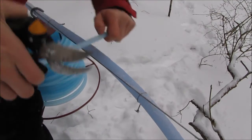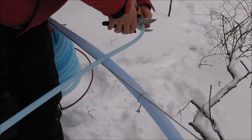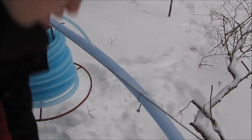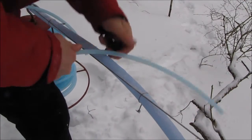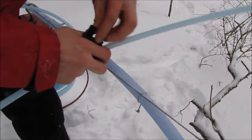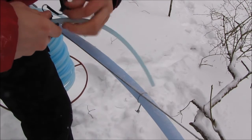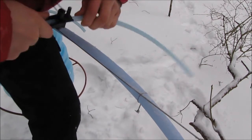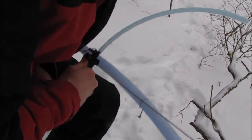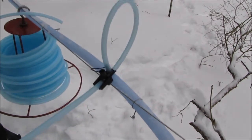Once you've reached the end of your line, you're going to pull it tight right to your wire and main line there, and measure out about 8 inches and cut it. Then you're going to pull it as tight as you can and put your piece on here — that's going to hold the tension off your saddle. I use these because they're adjustable. If you didn't put enough tension, you can bring it back without an issue — no cutting tubing or anything like that. And you're going to clip it on your main line wire, like that. Then you can wrap your tubing back around, put it on a piece there, and that's going to keep your tubing clean.